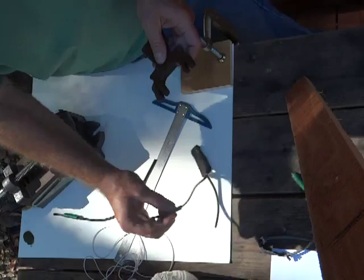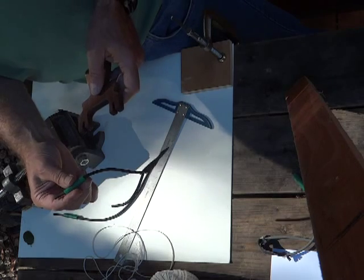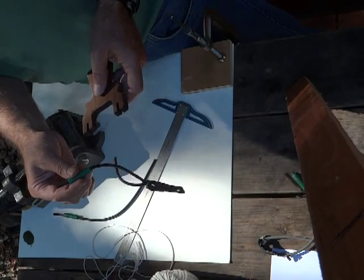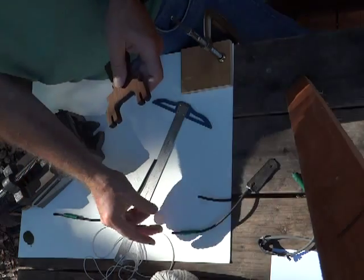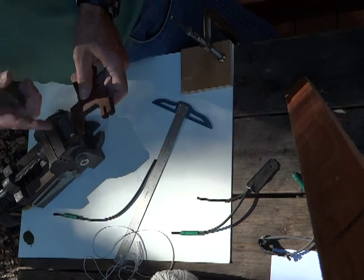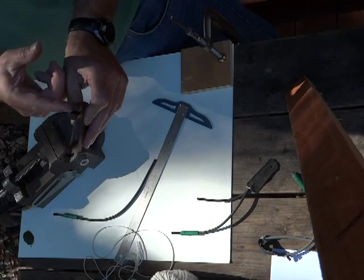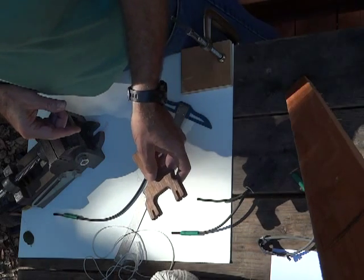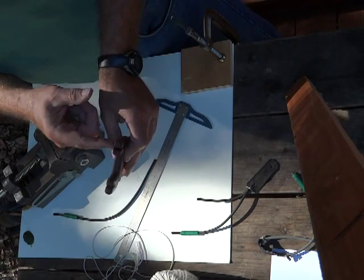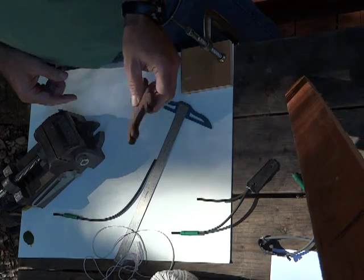Now for the green TheraTube sleeves, the inside diameter is 0.2 inches, the outside diameter is about 0.35 inch, so that means the inner-outer diameter difference is 0.15 inch. So the total of thicknesses of the rubber then is the 0.15 plus 0.1, or a total of 0.25 inch. And I said use 57% of that for the target for the slot width. And that comes out to be about 0.142 inches. Now, how do you control a slot with any kind of precision? I'll show you how to do that.